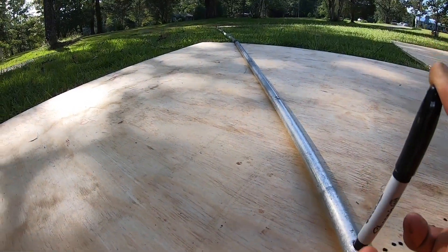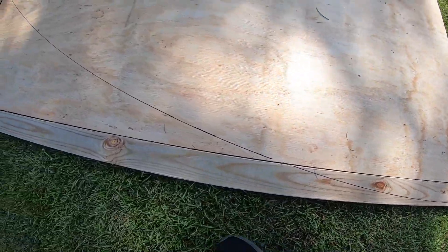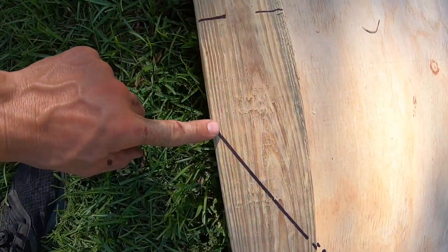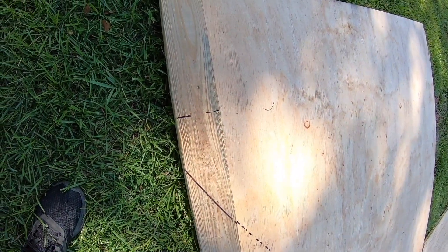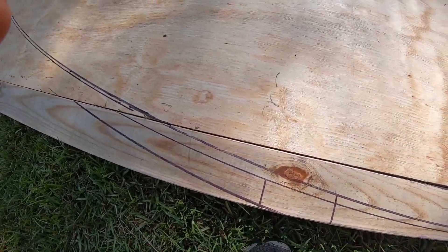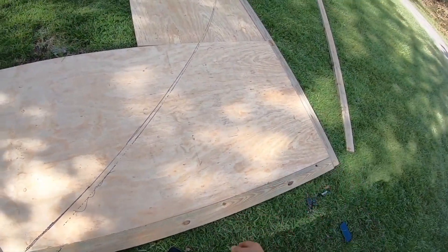I'm having to do dots because the pole is hitting the wood. Make sure you do this on a flat surface — this isn't quite flat. Looking at the bottom... I don't like it, that looks a little too mellow. I want to do a seven-foot lip — that's seven foot right there. The radius obviously doesn't meet there, but if I start it out further and bring it in, it'll actually come in steeper. I want to stop it right at that line. That's where we're going to cut — that way I can put a two-by-four across right there, and it'll sit on brick so it doesn't sit on the ground and rot.